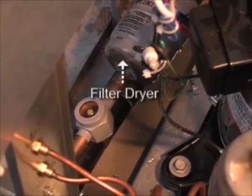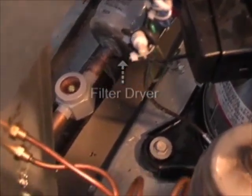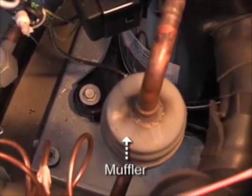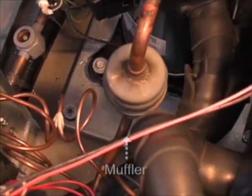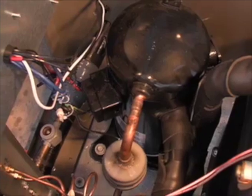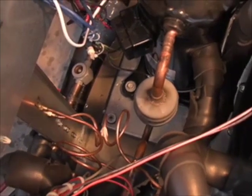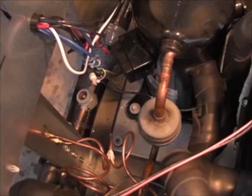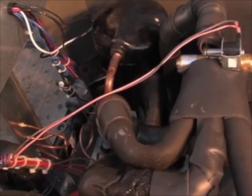Once you've replaced the filter dryer, make sure you've replaced only the filter dryer. The filter dryer is located on the liquid line — not to be confused with the muffler. The muffler looks exactly like a filter dryer and has similar UL listings, but it's on the discharge side of the compressor. If it's not wrapped in foam tape and down low, and it's on the discharge side, it is a muffler. Please make sure you're only replacing the filter dryer, not the muffler — if you install a filter dryer in place of the muffler, you're going to have significant issues.